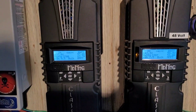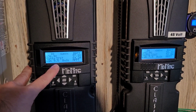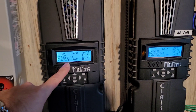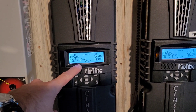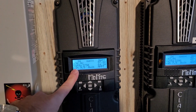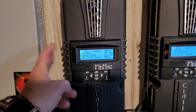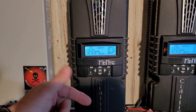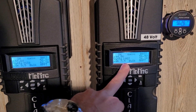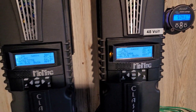All right, so we're back in. Every time we hit a little bit of cloud out there it drops it down some. I was actually quite impressed earlier to see it said 4,160 watts — it was pulling in like I said with 3,200 watts for the panels. Can't be any happier than that. I'll attach the pictures at the end of this video. The Classic 250 hits its amp limit quite a bit, so this will be a change-out.